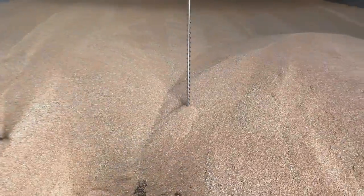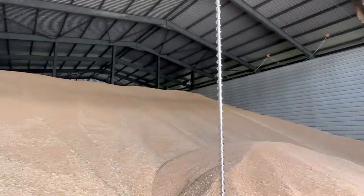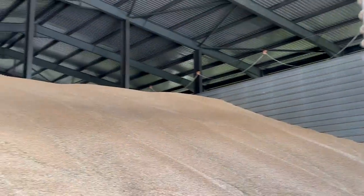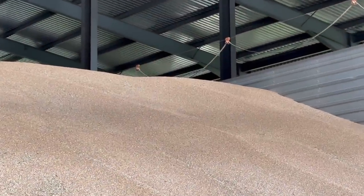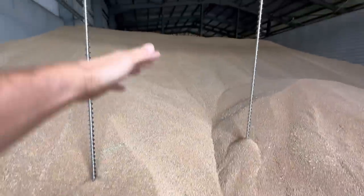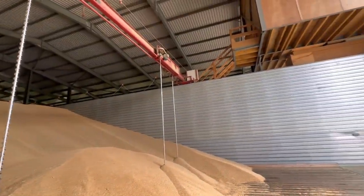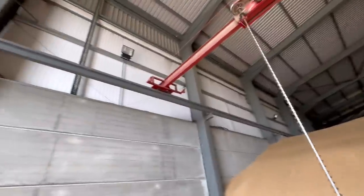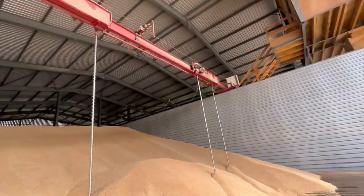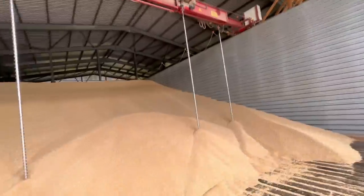That beam is going left to right ever so slowly, and that rod there underneath — where that bolt is under that wire, that bit of box section — connects to those pairs. You see the box section connecting there, and then you've got the same there, two augers. So the whole thing is moving left to right and right to left at the same time as moving on the tracking on top. Now there's that stop — it's pulled away from there because they've set it to go to the back of the shed, so it's now disappearing into the heap. We won't see the bottom of this auger again until we empty the shed. When we get it going into the heap, we move that stop to the very top of the heap, because once you start to bring the auger into the heap you'd be amazed at how much it walks the wheat down. So we always stop it just at the apex of the heap.